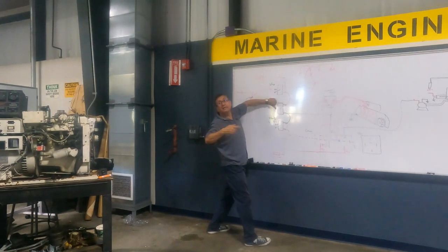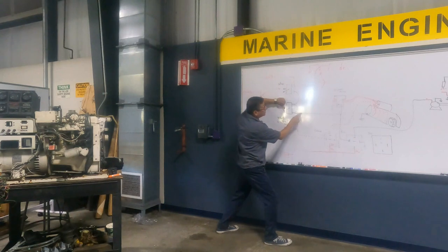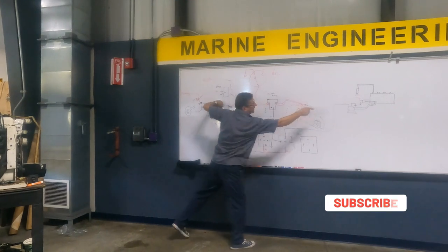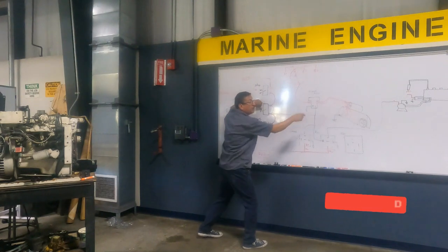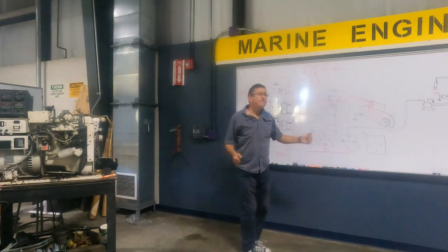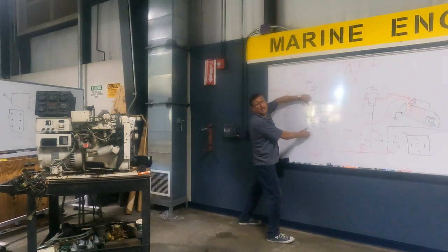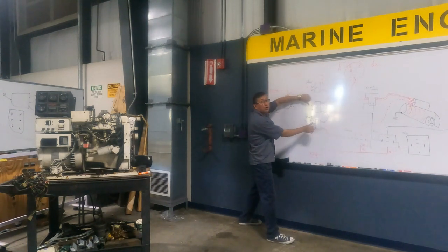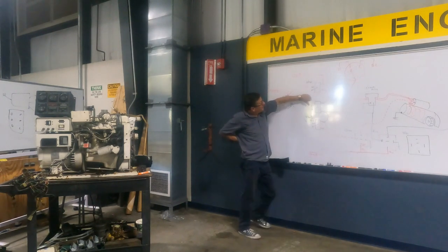The starter motor is cranking. And is fuel entering the engine? Yes, because I send power here, and this signal activates the pump and opens the solenoid. Now the fuel enters, the engine is cranking, and the engine starts. Bingo, the engine is running. Pay attention: immediately when the engine starts, I remove these fingers, because I hear the engine start and I don't need more cranking. Everybody follow me? No more cranking. Great.